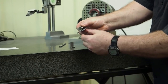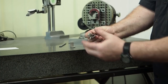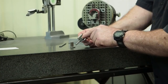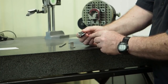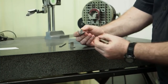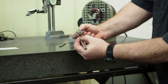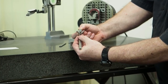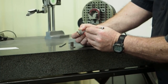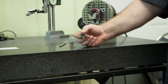And what I'm hoping to achieve here, I haven't tried it. You'll be the first people to see it. We'll see how it works when I do it. It'll be the first time I ever tried it. But we're going to establish a 3-point contact on the front and in the back. The 3-point contact is where this round is tangent with the 45 degree angle here, and where the part is tangent with the 45 degree here, and then the tangent point here on the top. And 3-point contacts work really good to stabilize things.